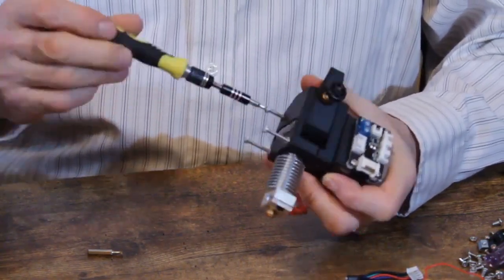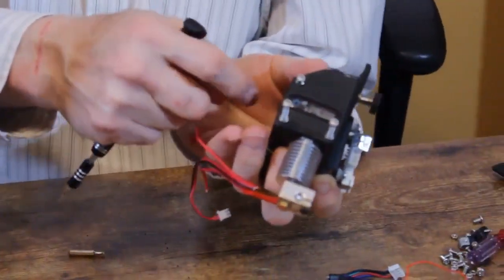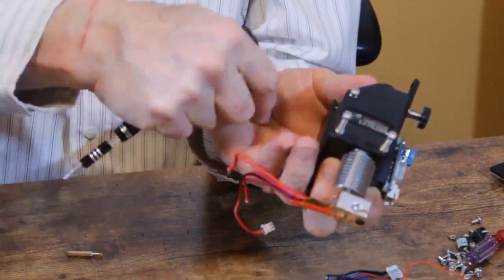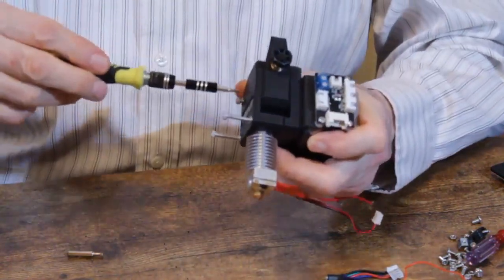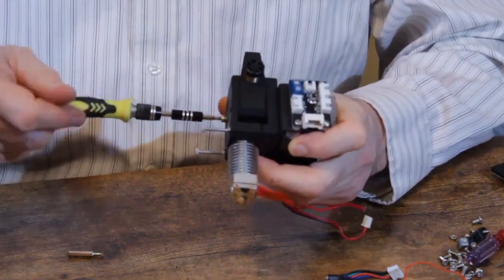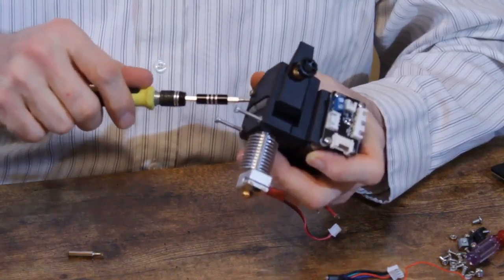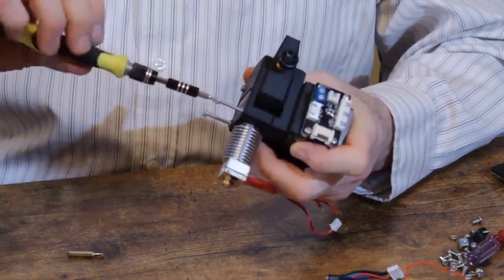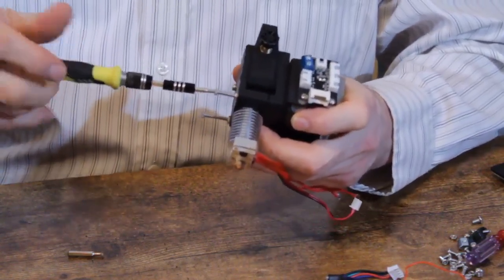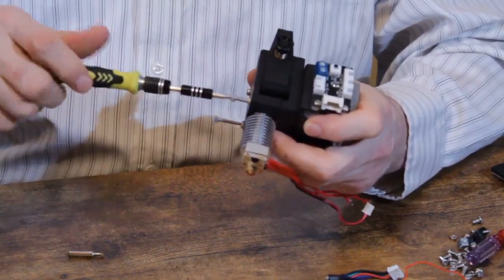get into the motor, the screw holes in the motor. As the bolt sticks out past the extruder and bracket, you just twist until it falls into the motor hole. Once you get the first one lined up between that and the motor shaft going through the extruder, you should be good. Don't ever screw anything all the way down until all the mounting points are in line, because there's always a little bit of play, and if you screw it all the way down, you're locking it in place when it might not be aligned. Like that.